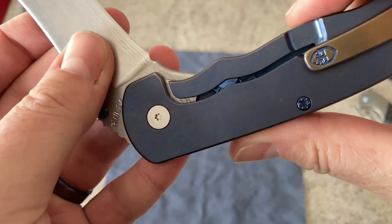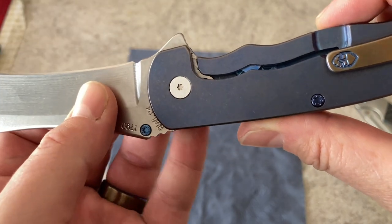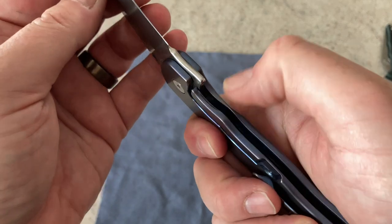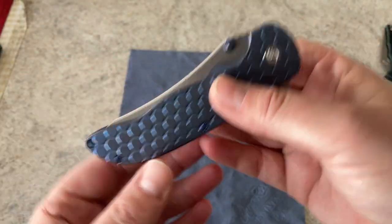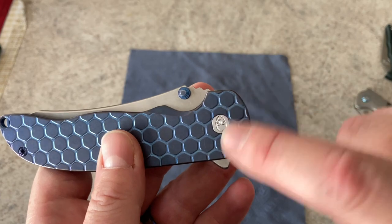As you can see, you can start to see it come up there, the ramp where it allows that detent ball to slide out. And so you don't have it hit. It's just so smooth. Once you unlock that, it doesn't stick and then pop past. It's ramped up. He put a detent ramp on it. And then the final thing is this has the double stop pin